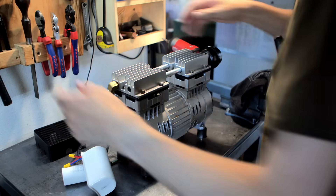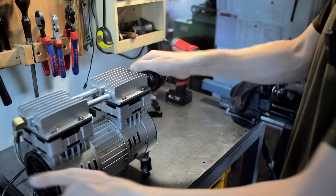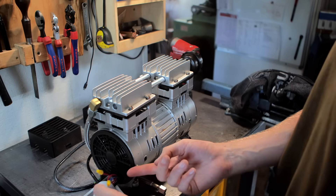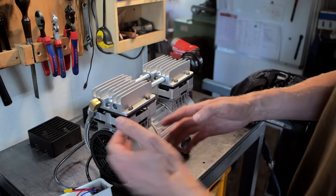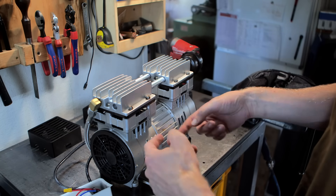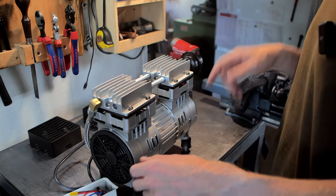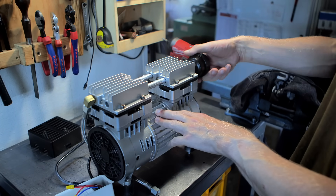All of these parts will go into scrap after I'm done. This is a 700-watt motor, single phase, 230 volt. This type of motor requires a capacitor to create the 90-degree phase offset needed to run an induction motor — that's something that dies very often, but not in this case.